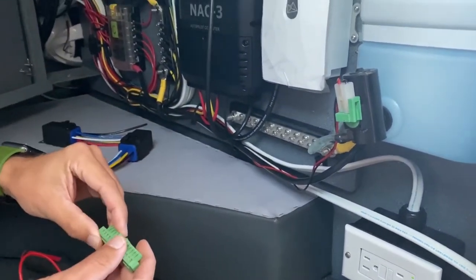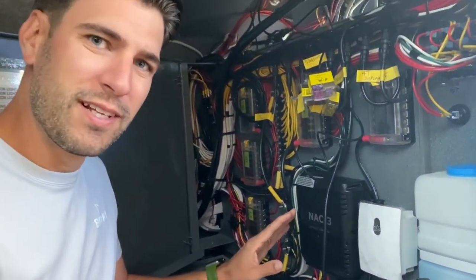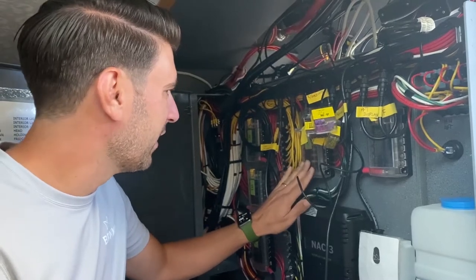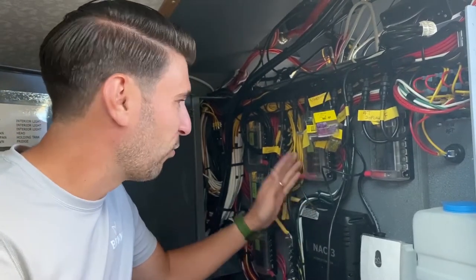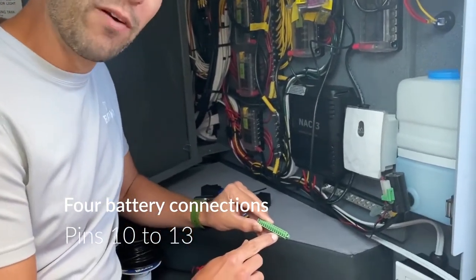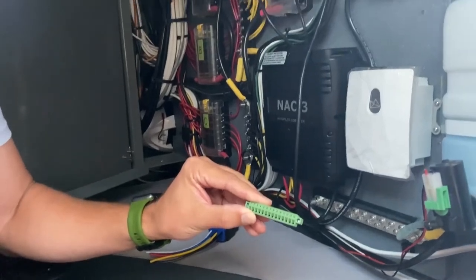What we want to do to power up the barnacle initially is to connect it to a 12 or 24 volt power source that's on 24 hours — unswitched ideally. This boat has a 24-hour panel so we'll add a 3 amp fuse and connect it into pin 10 on the base of the barnacle. That's our battery 1 input, which will get the barnacle powered up and transmitting its first data to the cloud and into the app.